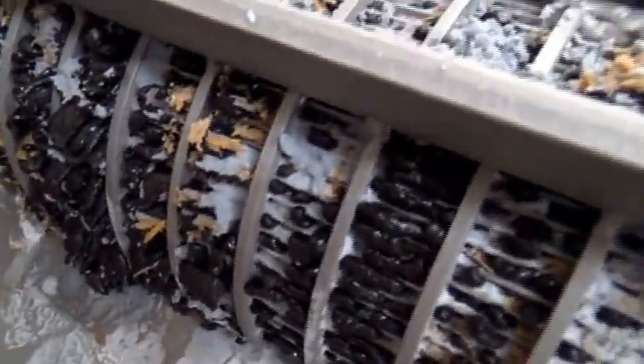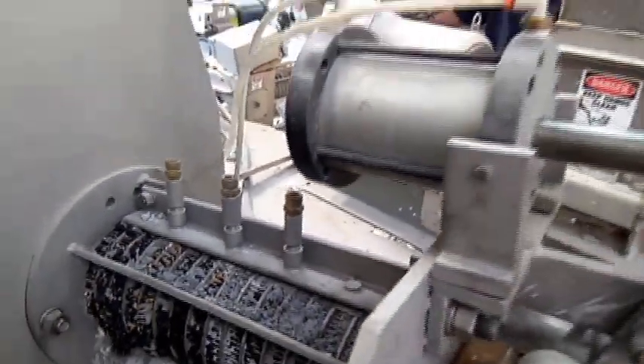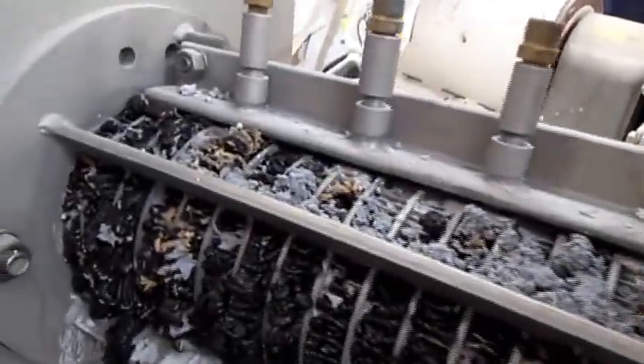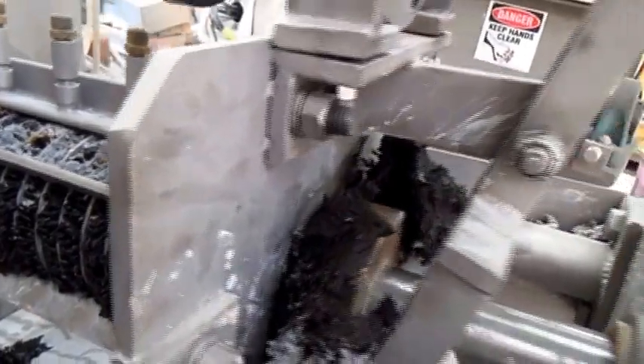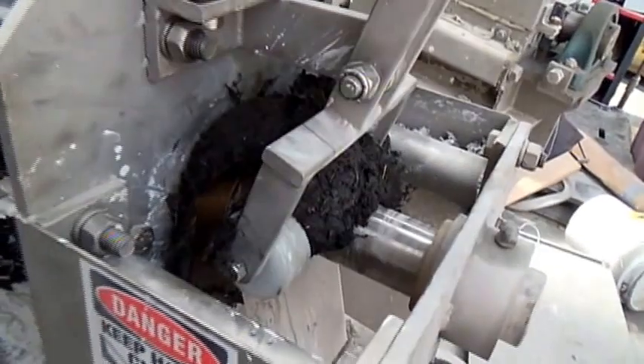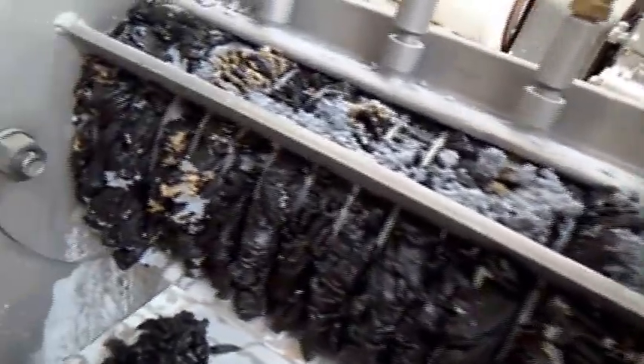We're already getting some stuff coming through the screen, but it's not a flow of oil. These holes are for steam injection — if we wanted to heat the material up while doing this, we could. It's progressing through towards the air cylinder where it comes out. I was hoping to get a flow of oil to come through this screen, but as you can see, I'm just getting mud. I'm going to set the air pressure a lot higher — I've reset it to five bar. You can see it's coming out a little thinner. That air cylinder is pushing the door more shut in an effort to drive oil through the screen.